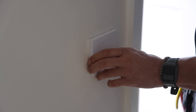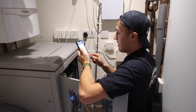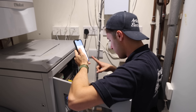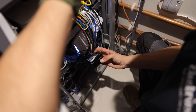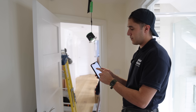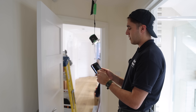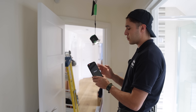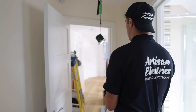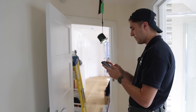You can get a variety of finishes as well. Now it's time to program the lights. I've just got into the system — I've gone onto my Lutron app and tapped 'access a local system'. I've connected to their wifi, found the hub, and just tapped the little button on the back of the Lutron hub. Now I'm inside the app — I'm going to go to settings, add device, and then it will let me select the type of device I want to add. I want to add a 240 volt inline dimmer, and then it should find them. It might take a little bit longer because we're quite away from the hub here. It's found all three, which is great — so we'll flash them. So we'll add that and we'll call that 'bedroom upstairs ceiling lights main' — and that's that added.